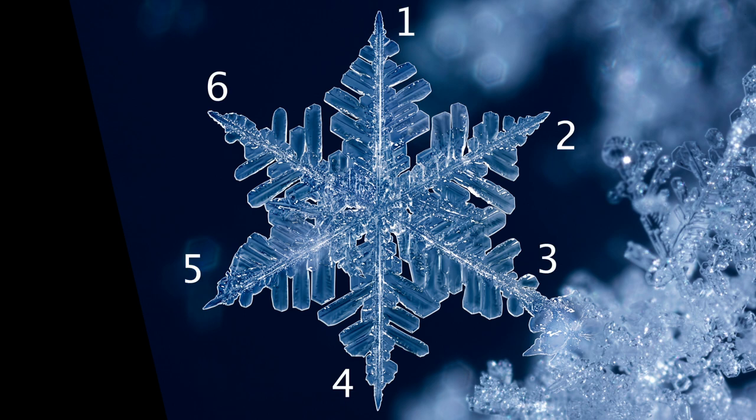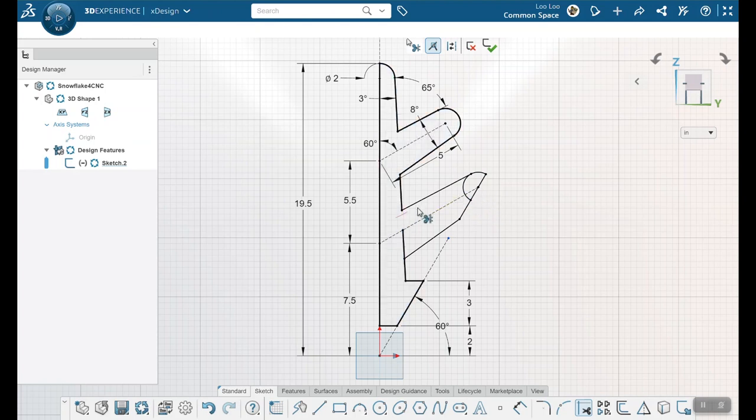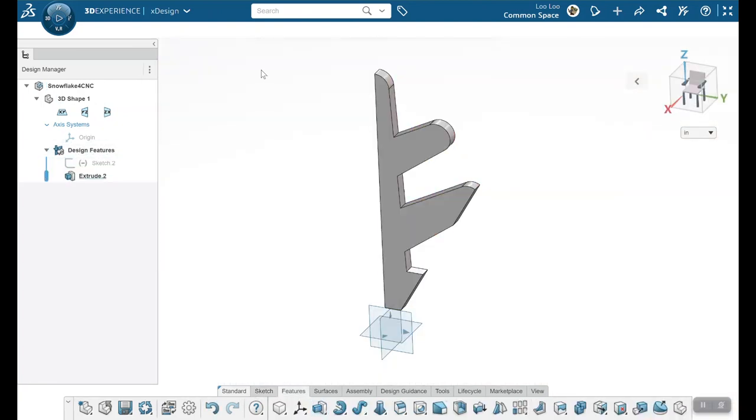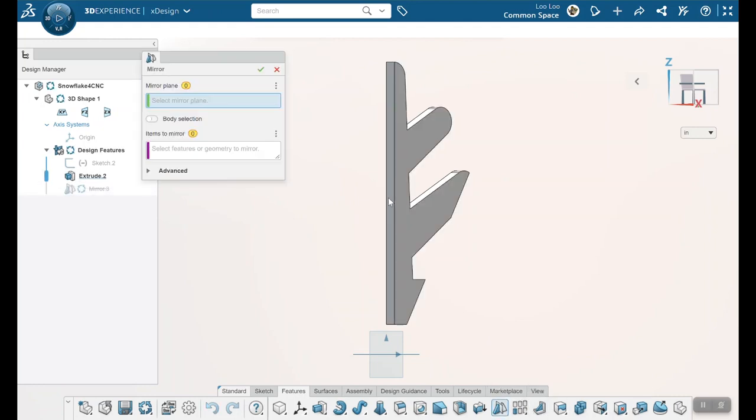So are you up for another project? One more on this wintry theme. I have these decorations that we were about to store away, and I think I have an idea on how we could use them and let them stay out a little longer. I'm going to try to show you what I mean in xDesign. A snowflake has six legs and on each leg is a mirrored pattern, so I'm going to take that pattern and make it into a sketch in xDesign. I can give it a thickness — when I extrude, I'm going to use three-quarters of an inch, which is the thickness of the wood we'll be using for the decoration.